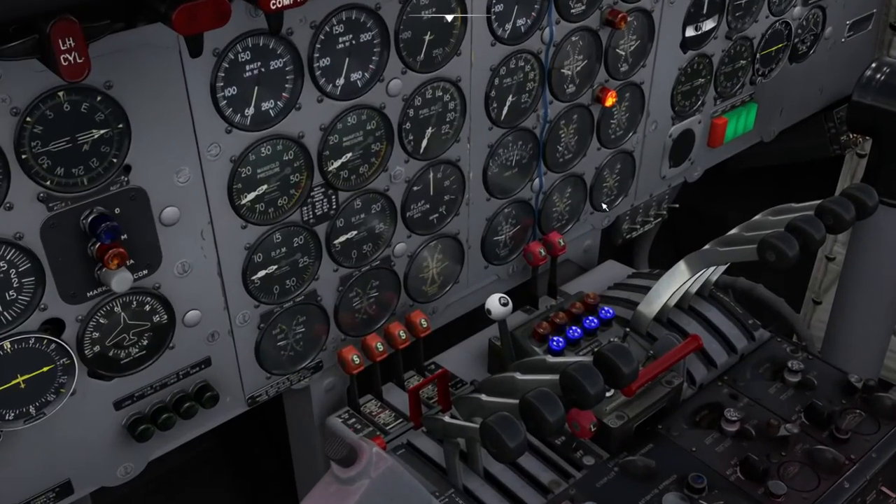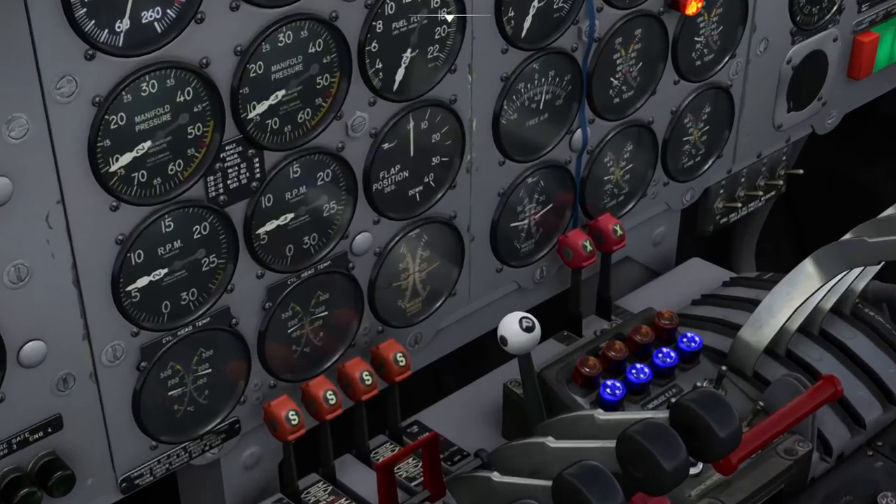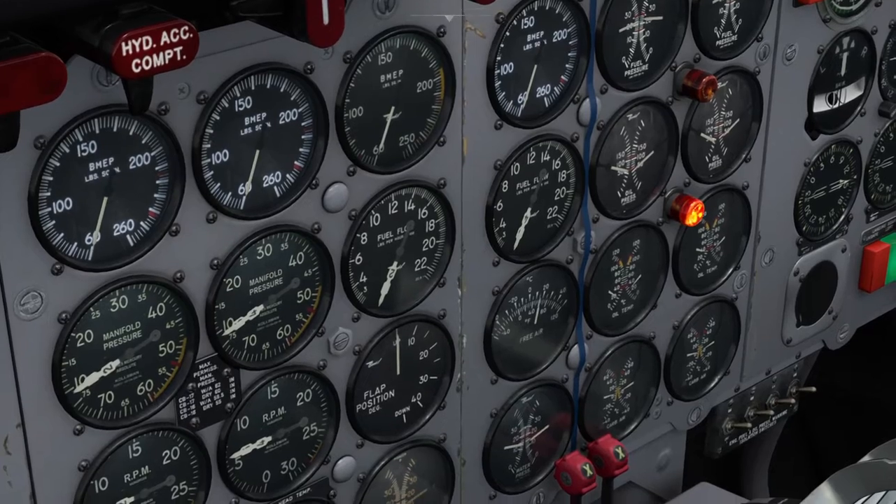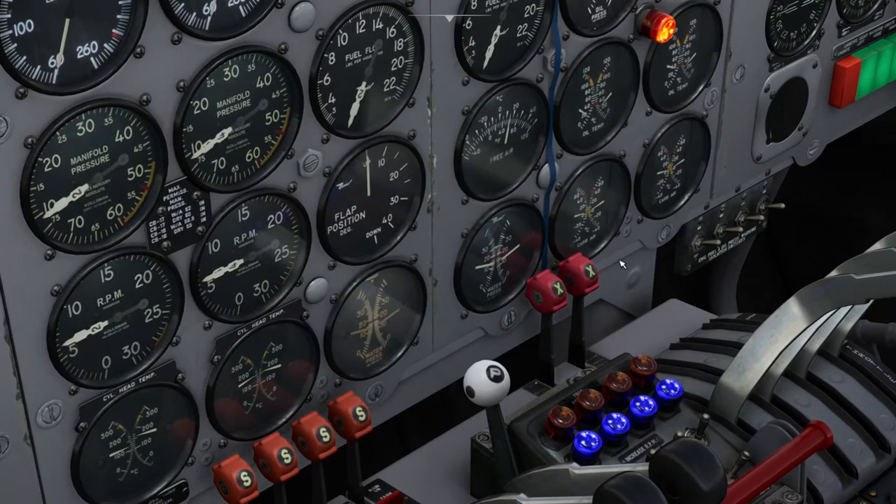Check to make sure — you should do this as you start the engines — there's oil pressure, we have fuel pressure, our oil temperature is coming up. We started three and four so they're up at 40. Two has come up to 30 and one is still cool, basically because of the order in which we started the engines. We've got good idle speed, manifold pressure is low obviously because we're at idle. Cylinder heads are warming up but not too hot, so we're good.